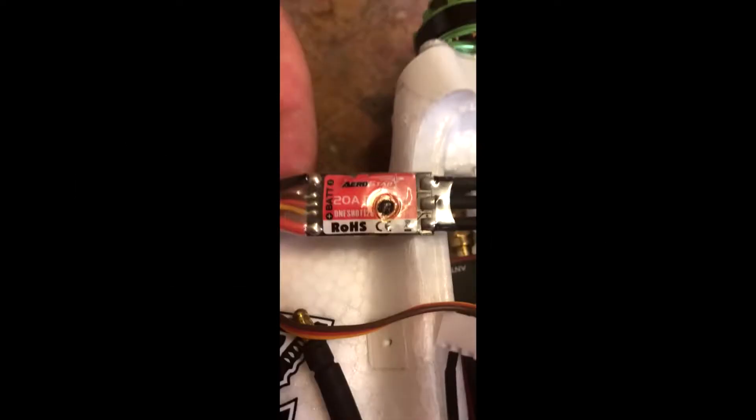You should hopefully see on the screen the speed controller. Basically, I came to do the dry run, put the propeller on, and the speed controller decided to catch on fire — kind of catastrophically, as you can sort of see. In my opinion, that's the BEC that's burnt out, and it just burnt straight through the plastic. It was still plugged in though, so I started waggling the servos, heard pop, crack, crack, and smoke started rising out of the plane. And that's what I was left with.